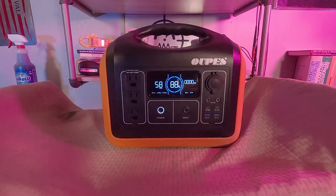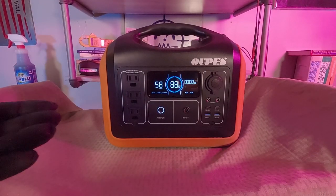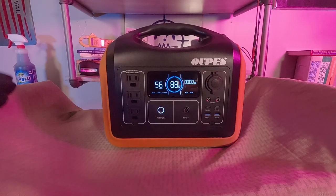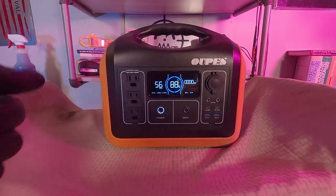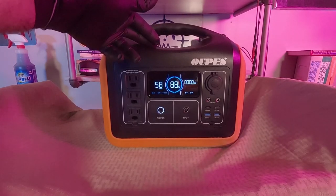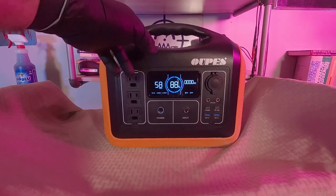Once it gets running, the motor starts to coast and your amperage drops down once it's going. Same thing with the vacuum pumps. It was cold, the oil was thick, and once it started to run, the amperage started to drop. Also, as I mentioned once before, this can be charged with anywhere between 200 and 240 watts of solar generation.